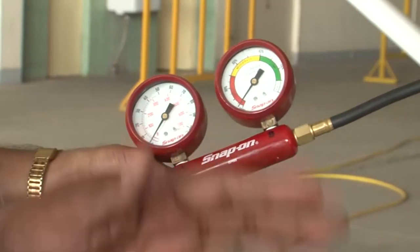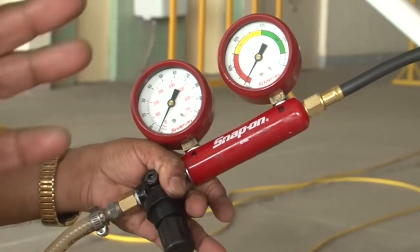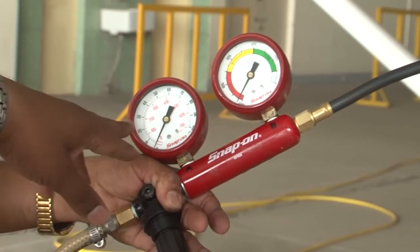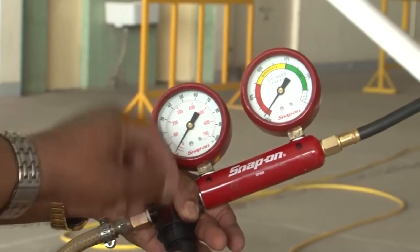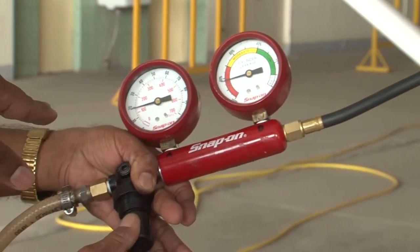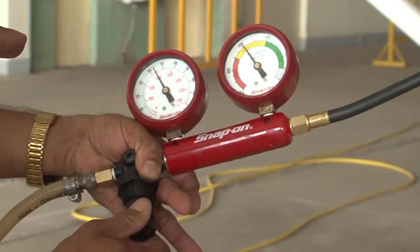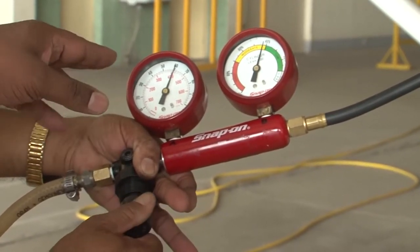So people are holding the propeller properly. We have to be very careful while holding the propeller so that the propeller doesn't move. And now we are going to give an input pressure of 80 psi, which we are going to observe and regulate from this point. This is the regulator, and you see that the pressure is gradually being given here. You see, gradually we are giving 80 psi pressure,